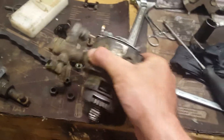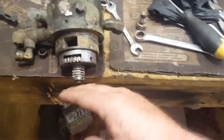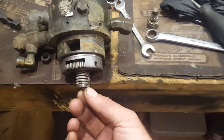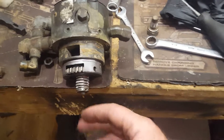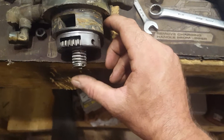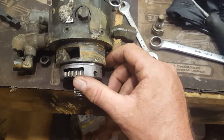I'm just trying to tell you what you need to do to solve this issue. The reason these buttons fall off is because the plunger gets stuck in the up position like this, and then the tappet comes up and it's just slapping the bottom of it. The button will move in and out just a bit, and when it's getting slapped over and over again eventually it'll crack a little ear on that retainer. Then the retainer falls off and the button and retainer are just bouncing around, not providing that last eighth of an inch of stroke to build the proper pop pressure for the injectors.